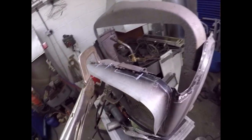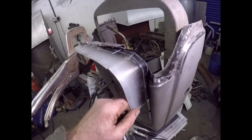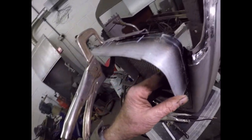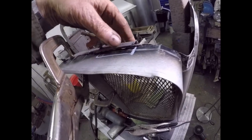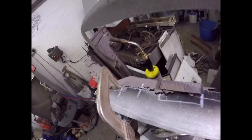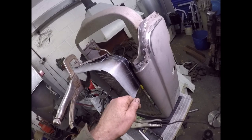The second part is taking shape. I'm not sure where this edge is going to end up, but I know it wants to be turned up about like that piece there. I've folded a flange on the back and cut some little V's out on that corner to take that up. I'm going to take this piece off, cut that off, take this bracket off, get all that out, and weld the bracket back in that position. I've put little cross marks on here so I can get the metal exactly back in the same position.